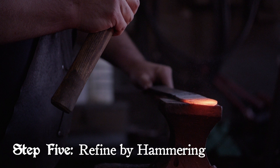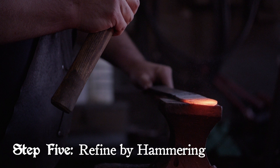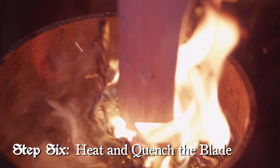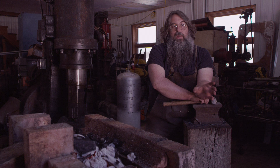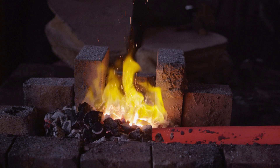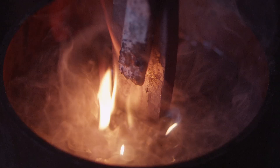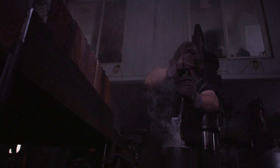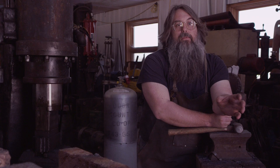From there it gets refined by hammering, so we force it into the shape we want it to be in. Then we heat that entire blade up and quench it. The quench medium can be oil or water — there's grounds for both of them in Greek history. We'll be using oil. So we heat the blade up to roughly 1450 degrees Fahrenheit, what I perceive as a dull orange. It's that severe temperature change when we pull that heat out that the blade gets hard. Depending on the chemistry, we have very little time to cool — a matter of seconds. It's very severe on the steel — you can have it crack along the cutting edge in a hundred different places and then you have to start over.